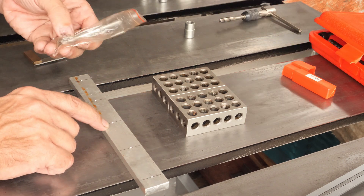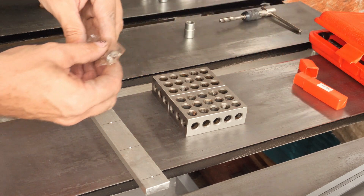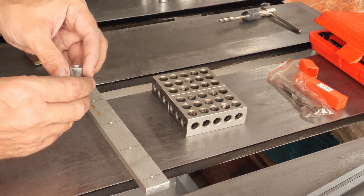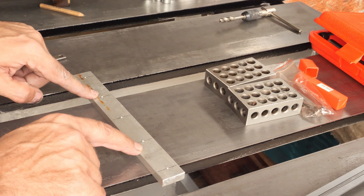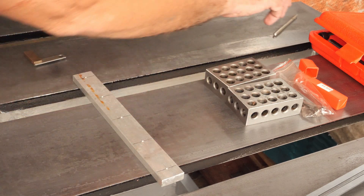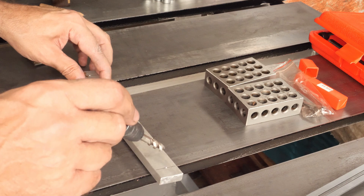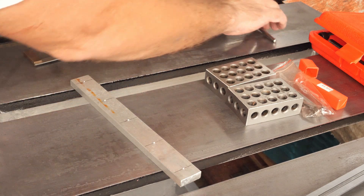The center hole will be drilled using the Forstner bit, 15mm, which is matching the stainless steel inserts from my other jig. So I can make double use of these inserts because I have inserts for all sizes. These side holes will be drilled with 7mm and tapped to 8mm, so that I can put 8mm bolts which will act as stoppers for rotating my jig on the material.